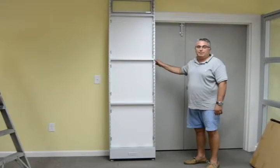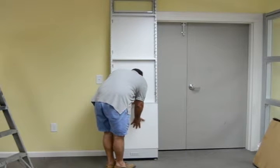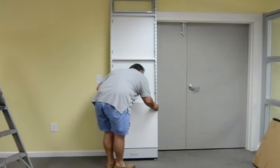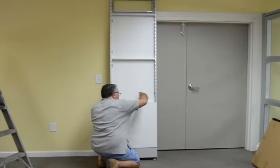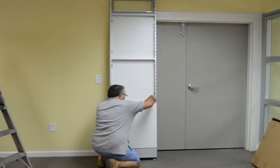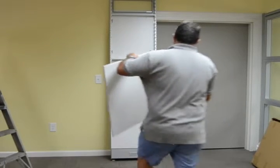This is your first step. Installing number 1. Line it up, you can see locks. Lift up slightly. In place, use a mallet. Tap down, make sure it's level. Leaving a 1/4-inch gap here. That's your first tile. Installing your second tile.